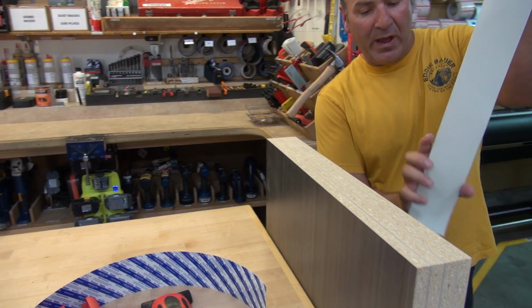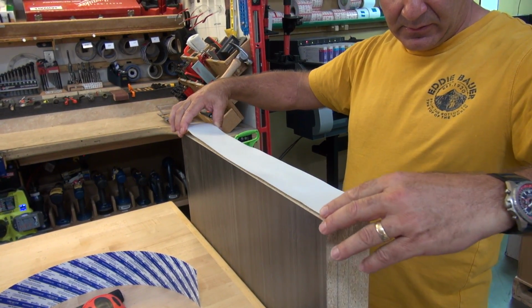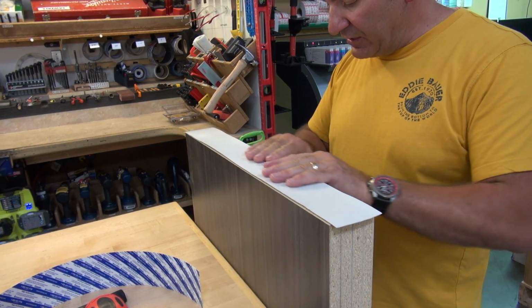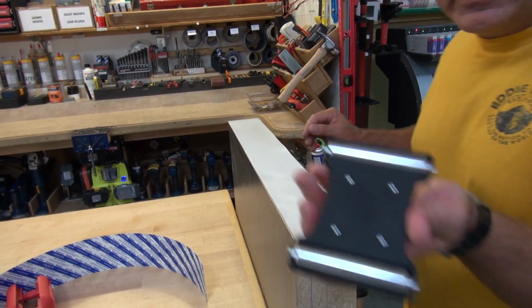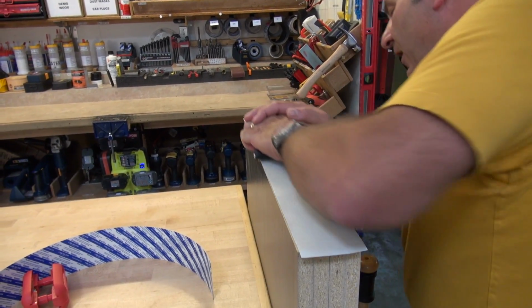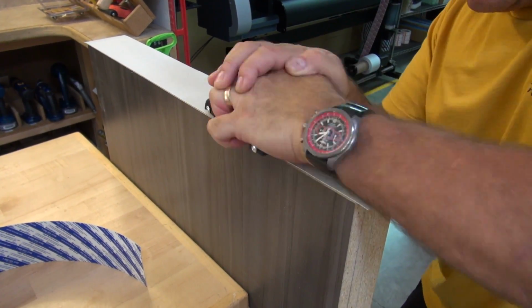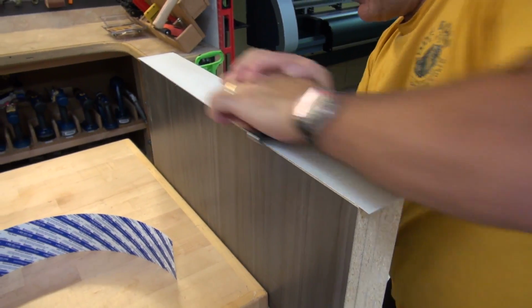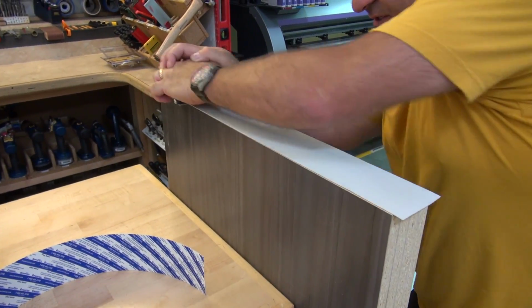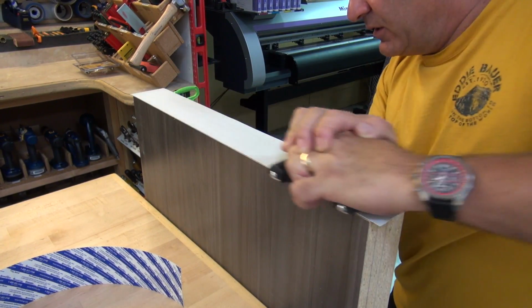So this is one way to do it. I'm going to line it up on the edges. Drop on both edges, everything's good. Everything's on there. We're going to take our roller with steel wheels, very, very important, and we're going to roll like crazy because we want to work that glue in. Now, the first time I do this, I'm going to trim it normally without heating it anymore with the iron.